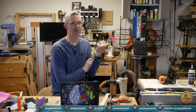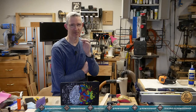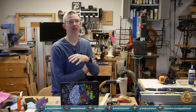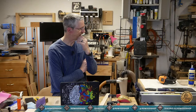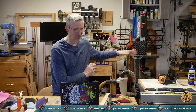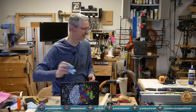I think Wednesday when I come back, I might pull those out tomorrow. It depends. I might pull those out of clamps tomorrow and just get them kind of flattened out. And then I can run them through the planer and get them flat so that come Wednesday, we can cut them, flip them, and re-glue them again. And then I will work on my coffee table while those things are gluing up, because it's going to take a long time for that to get done anyway.